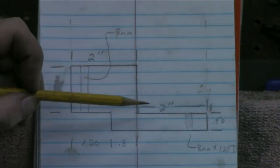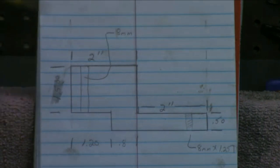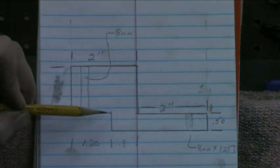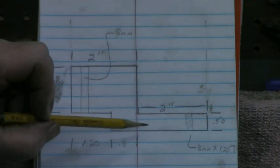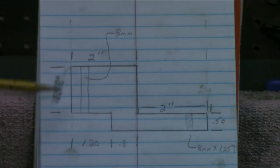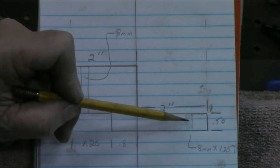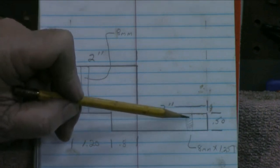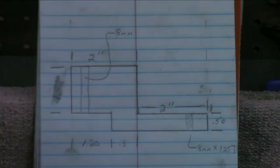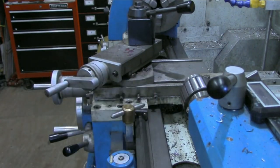Here's a rough drawing of the bracket we made to offset the carriage lock clamp. It's a piece half an inch thick, four inches long, by two inches high. This step is two inches here, another two inches down — on mine, 1.2 for the solid block, 0.8 for the other section, two inches over here, and this is a half inch high leaving an inch and a half on this side. This end is drilled and tapped for eight millimeter by 1.25 pitch thread — that's what the original lockdown screw on my lathe is — and the other end is drilled for an eight millimeter pass-through.